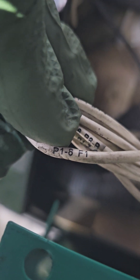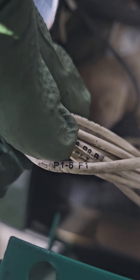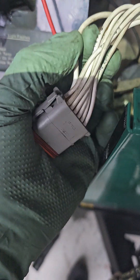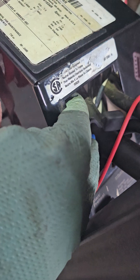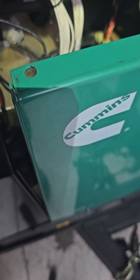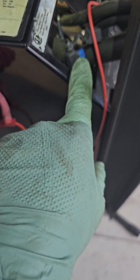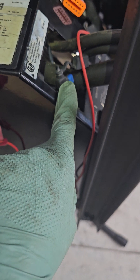I found the Cummins flowchart by searching the code on Google, which gave me a free PDF directly from the Cummins website. So this P1-8 F1 check is a fail — somewhere between the battery and the plug something is going on. The wires are actually thinner than expected on the main feed line. I've got to take the front panel off and figure out why there's healthy voltage at the battery points but not at the plug.